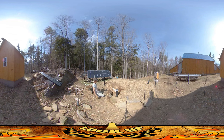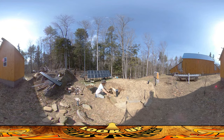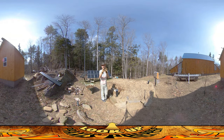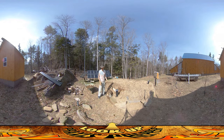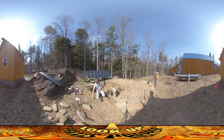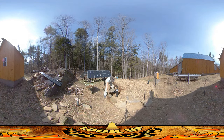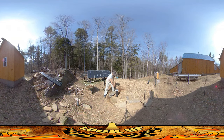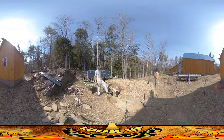I think something like that ought to do well. When I'm doing walls, I like to have a big rock that's nice and stable, and then another big rock that's nice and stable, and if there are some smaller ones I'll wedge those between because the two big rocks on the side kind of stabilize all the little stuff in the middle. And like I was mentioning a few days ago, I like to cap it with something sort of big. For this one, since it's a kind of small rock, I want to take one of these longer ones and have it kind of be like this — so it'll grab the top face and anchor it in there. Once I fill it in with dirt over here, I think that'll anchor that guy in.